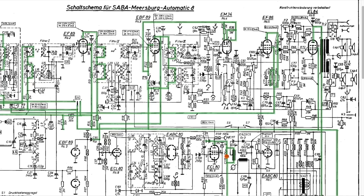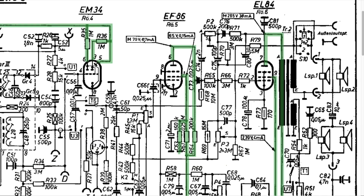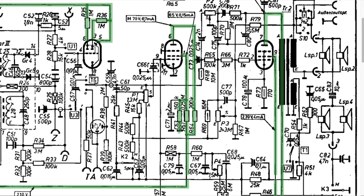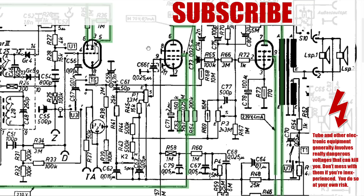So what's next? Well, next is this over here. What I'm going to do next is check all the components around the power tube, around the preamp tube. And then I'm focusing on the input of the external source — tape or phono — and I'm going to follow that through and do this whole audio section to get it working. So that'll be the next stage. I'm going to sign off for now. I hope you've enjoyed this. If you have, click like, share, subscribe and all that jazz. I'll see you again soon for another video. Thanks for watching. Bye for now and stay safe.